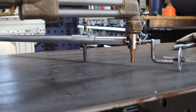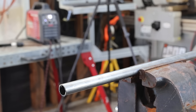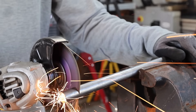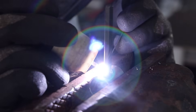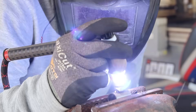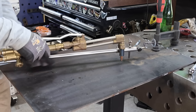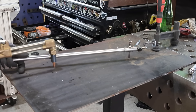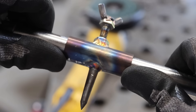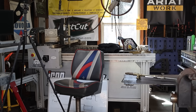That's perfect - that's exactly what we're looking for. The wheel rolls and we're keeping the same distance off the plate. Now I want to add another tool to this - we're going to take the same sliding tube and add another set screw option. Using the cutoff wheel, cut another portion off, add another piece of that Allen key we cut off, and I can turn this around off that wheel and use it to cut linear lines as long as I can hold it pretty steady. This is a quick way of doing things, seems pretty light in the hand. Now I can close everything up by putting this ball bearing on the end of the circle cutter to seal the deal.